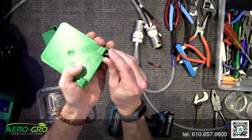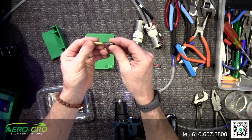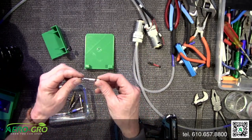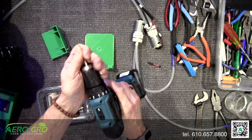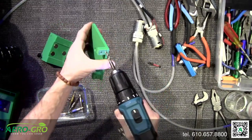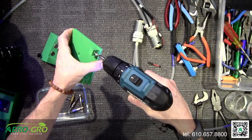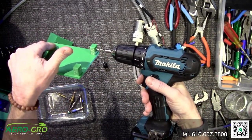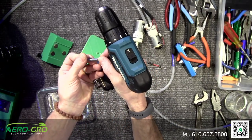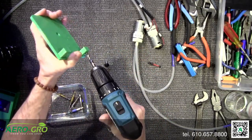And now you'll find that a 5mm thumb screw. Oh, did I have the wrong one in there? I think I had 4mm. I did. Oh my God. Only on camera. This always happens when I'm on camera. Yeah, 5mm. Okay, I was 1mm short. That was a 4mm. I'm gonna recut with a 5. That's okay, you can do that, as long as you're going up. You can't go backwards. You can't go from a 5 to a 4, obviously. But you can go from a 4 to a 5. That is a 5, right? Yeah. Yes. Boy, it looked unusually large for a minute. I'm not sure, that was weird. Okay, looked like a 6.